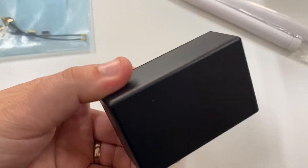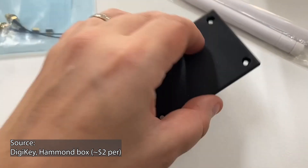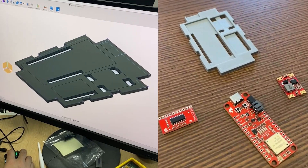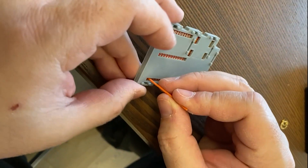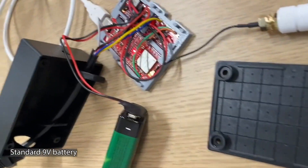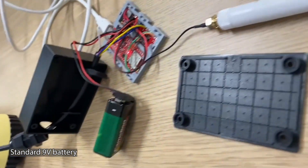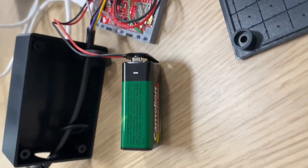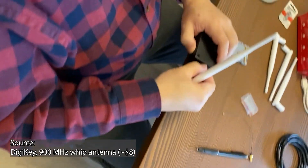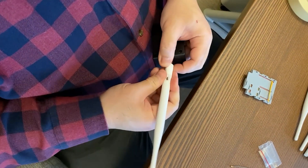For the outer housing, we wanted a small container suitable for the installation environment, so we found a cost-effective option around 2 inches by 3 inches by 1.5 inches. We designed a simple tray to sit snugly in the box and hold the three boards in place, keeping the wires cleanly organized underneath. We put a small 9-volt battery inside and connected it to the power supply — the design allows either the battery to power the unit and gas meter, or the meter to power the unit. We added an external antenna connected to the UFL on the SparkFun board, with an SMA connector on the exterior so any 900 MHz SMA antenna can easily be swapped out.